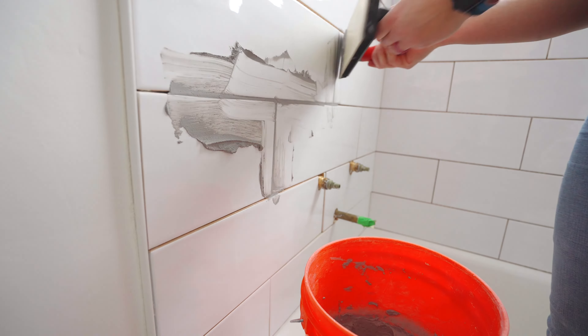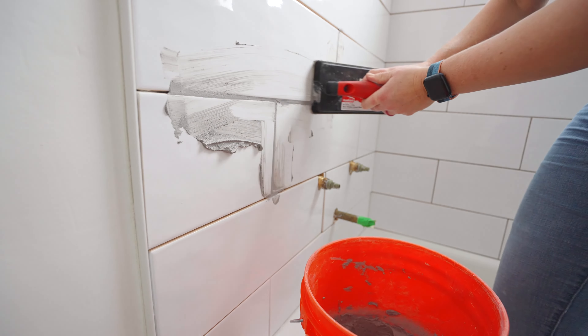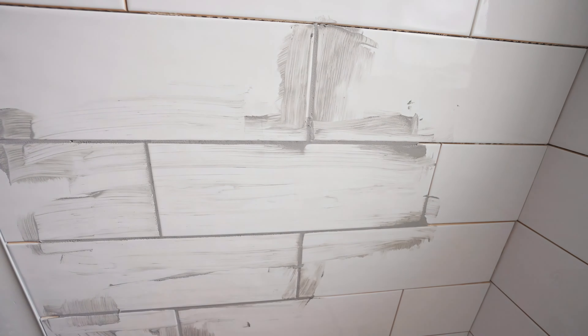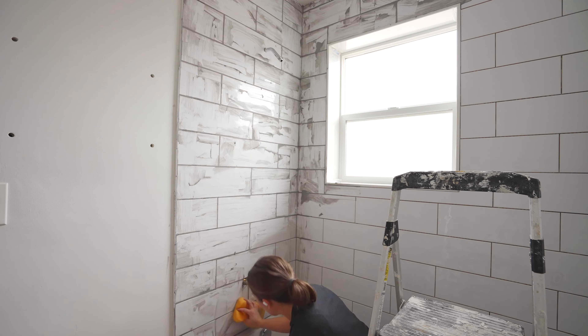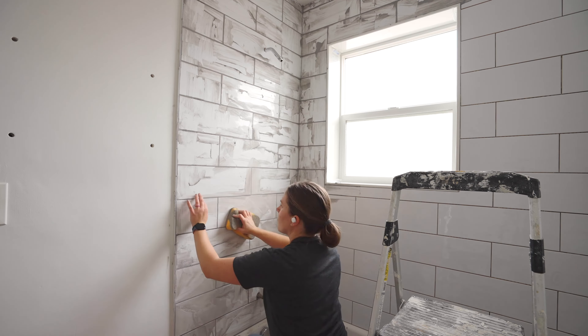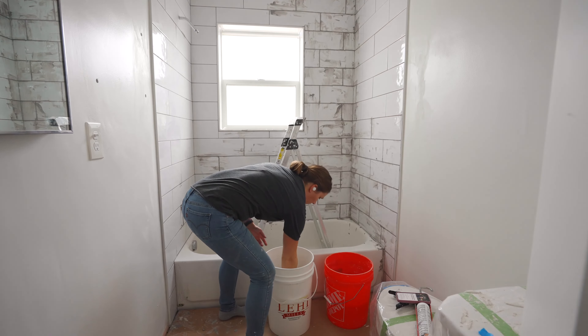Hopefully that makes sense — it was something I learned towards the end of my grouting that made it a lot easier. You're just going to apply this to all the area. You should only mix enough grout that you can install in 20 minutes, and after that you're going to use a damp sponge and wipe it out.